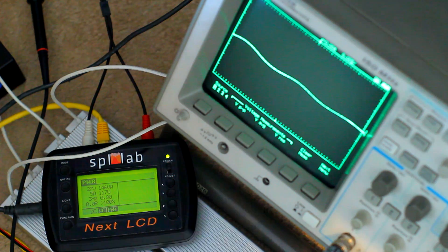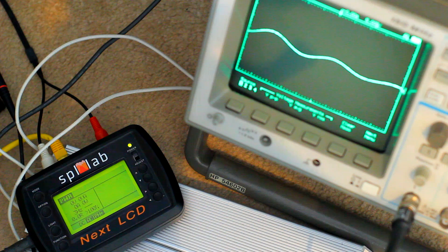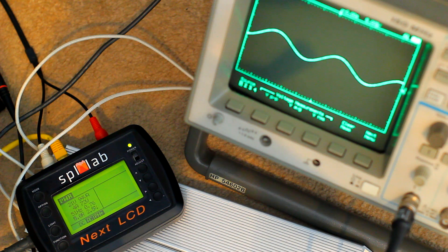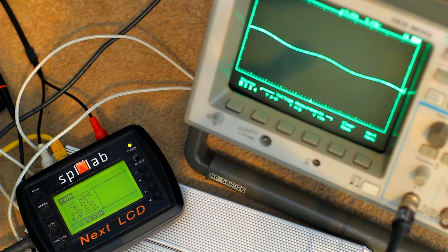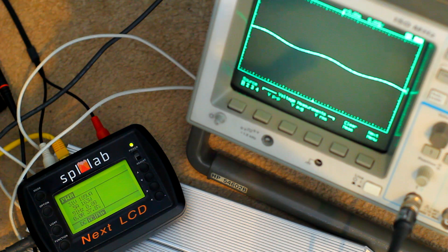The difference in size between the 550 and the 650 — I am quite excited to see the results from the bigger amplifier. It's massive. So now the fun starts. We've got the 650 hooked up and we're going to start with 8 ohms this time and run down into the lower impedances. Let's hit the volume knob and see what sort of power we're doing. Who guesses this will do more power at 8 ohms than the 550 did at 4? Let's keep it going — a little bit of clip there. Let's take it back down. That was 163 watts at 8 ohms. Google tells me the 650 is rated for 90 watts into 8 ohms, and we've got 163 on the screen here — getting on for double its rated power at 8 ohms.